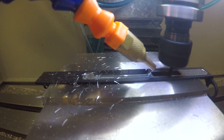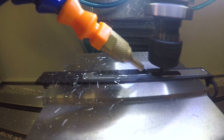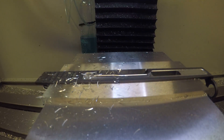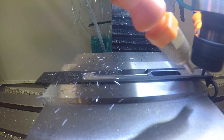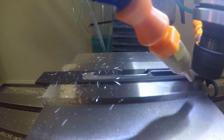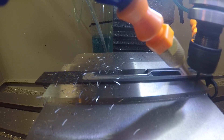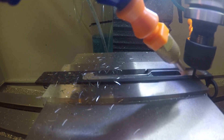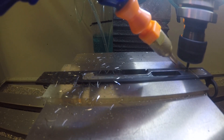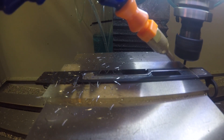After this we're going to swap over to the 7/32" end mill and do a full slot. These serrations are only 30 thousandths deep, which is plenty easy to handle for a carbide 7/32" end mill. We're going at about 1 thousandths per tooth, which is about 11 inches per minute with this 4-flute end mill, and it handles it very well.